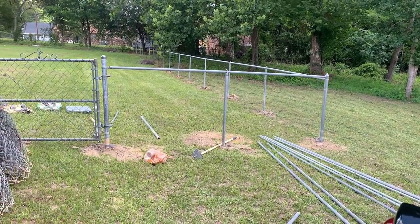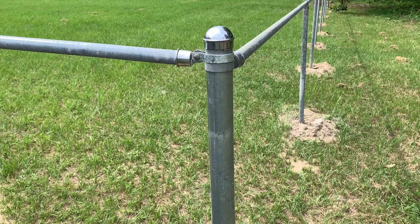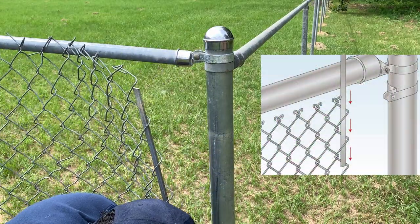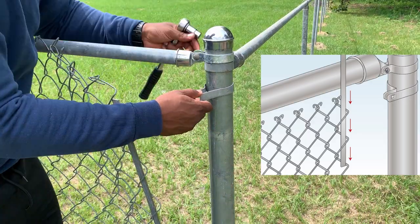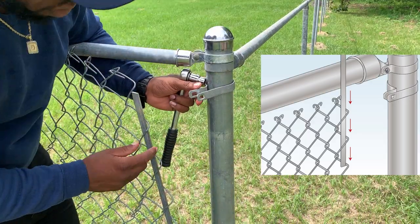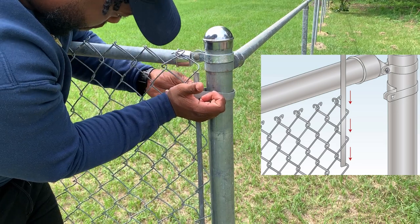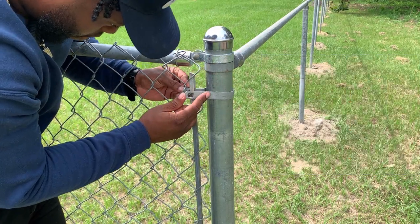Now to our wire mesh. At the end of your wire mesh is a tension bar. Using carriage bolts, lock the tension bar into place. This was a 1/2-inch socket. Try to evenly space each tension band to provide a uniform pull on your mesh.